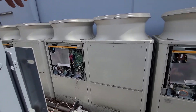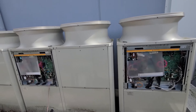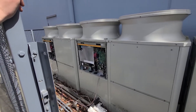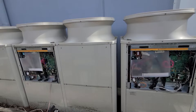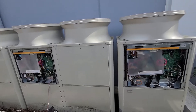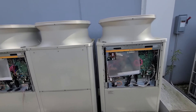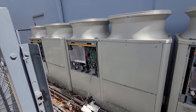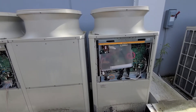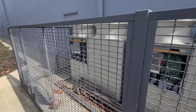I power cycled everything off. Tech support had me wipe the units so they weren't identified with anything, then re-booted them to make sure it wasn't a board issue. I went through the process of wiping the slate so none of them were trying to take the master spot. When I powered back up with all the TB3 jumpers disconnected, I had 29 volts on all three of them — that showed me all the boards were good.